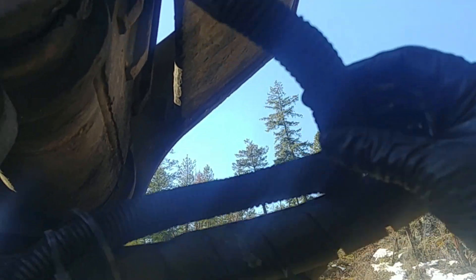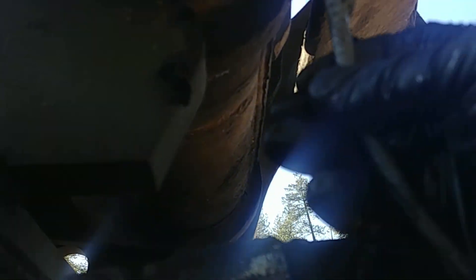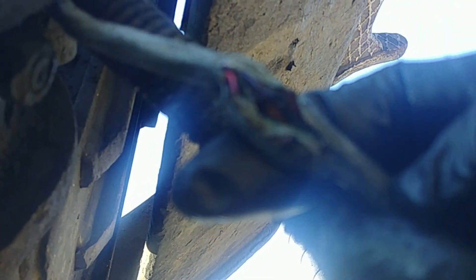Going from the grapple up through the hole in the housing, looking for contact points where the harness is most likely to rub against sharp metal edges. And here we go — we found it. Look for the contact points, that's the most important thing and the money saver.